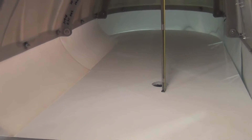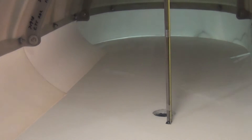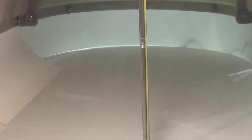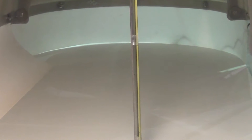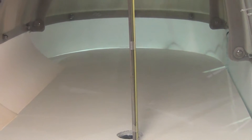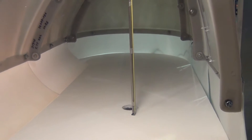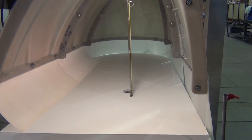Down on the end of the hood where it curves around, the end cap portion is normally 2 inches longer, and that 2 inches would go down into the crop canopy and seal the end of the hood. Since we're running on a table top today, we've had to trim off 2 inches of that so that the end will seal down on the table top.